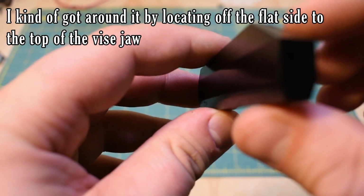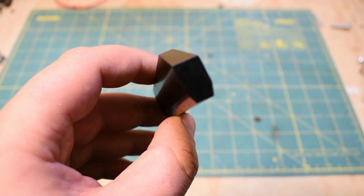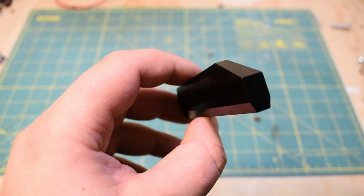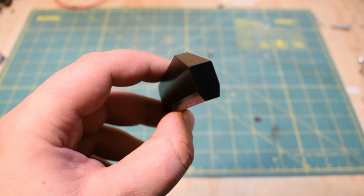Secondary bevels, I had this in a toolmaker's vise, and I actually tilted it a little bit, and I put the toolmaker's vise inside of a larger vise, and I used that for machining away these compound angles. You'll notice in the footage that the small toolmaker's vise isn't really gripped very strongly. Not a lot of material is being held.